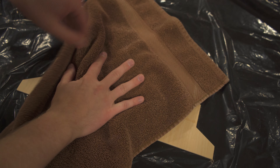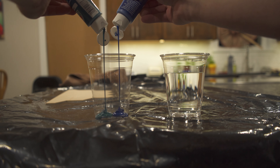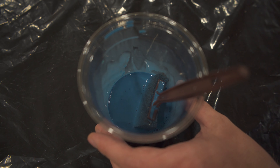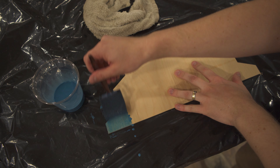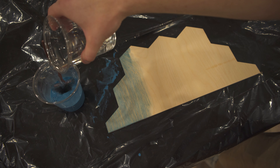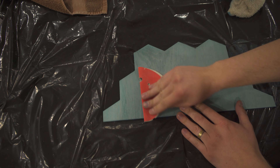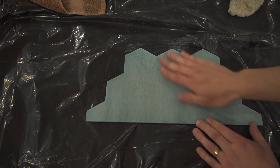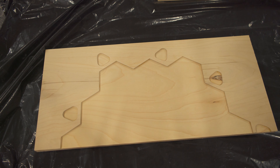Right here I'm getting a scrap piece of wood ready for the dye. I wanted to keep the grain visible, which is why I'm not just straight up painting the boards. I'm taking a page out of YouTuber The Craftsman Steady Crafton's book for water-based wood dye — basically mixing acrylic paint with water to make a wood dye. I thought it would be important to practice, since at this point messing anything up would basically ruin everything and send me back many hours. So once I got a color I was happy with, I let it dry and gave it a quick test sand because it popped the grain. It did bleed onto the back, so I set up some scrap wood to keep my boards off the work surface. And after determining that this would work, I moved on to applying it to the actual boards — and immediately spilled my mixture everywhere.